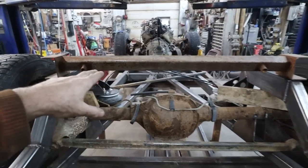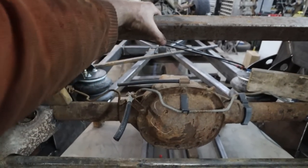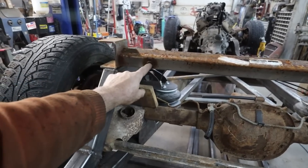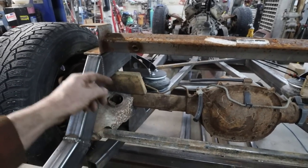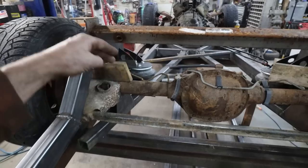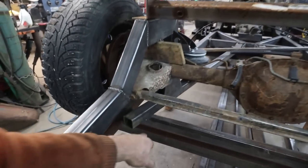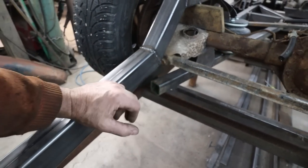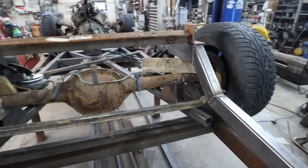That said, I did put a four bar, and this is one of these Speedway kits for a 50-50 Chevy, and this, I didn't need this, but I have this pipe with a nice positioning for a shock, so I can kind of buzz that in there, I think, try to repurpose this, and then we can make a shock mount if this works out, and I can put it there. If not, I can put the shocks on the front side, but we'll see. I have all this extra girth there that I don't know why I made it that much longer, but meh, no big deal. We can cut it off, but maybe I can repurpose some of this for a shock mount and stuff.